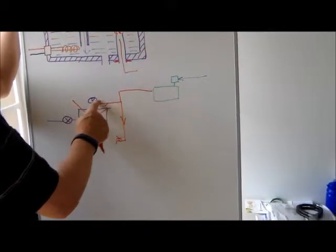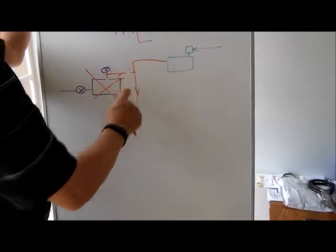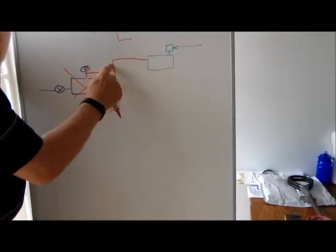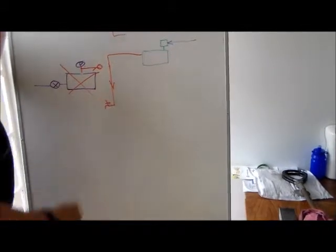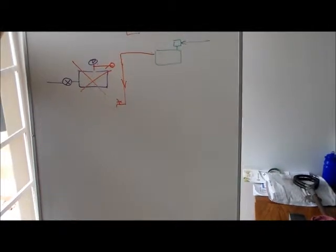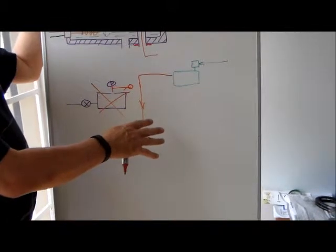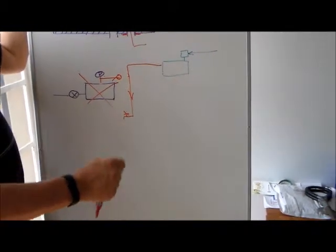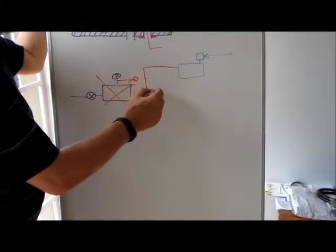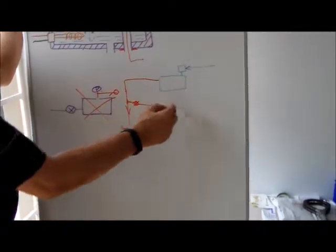So we can't do that. What we'll have to do is break the connection here. So what I'm going to do is cut the pipe and put a stop on there and just feed the warm water straight to the bathroom and kitchen of the flat. So the installation that we've done is on the roof of a granny flat. There's also a main house. What I'm going to do is also put a T section in somewhere here, block it off, and if I'm happy with the pressure, I'll connect it to the rest of the house.